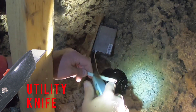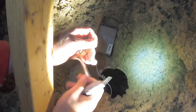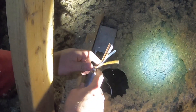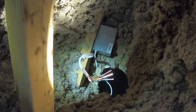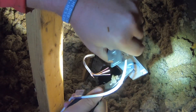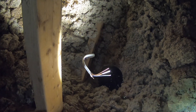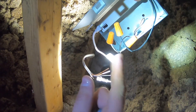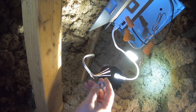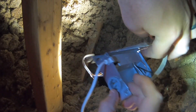We've got a little bit of work to tie all this together. We're going to cut about six inches worth of wire, make sure it's a nice straight cut, peel this back and cut it - just like that, and you have all three of your wires ready to put in the box. Go ahead and take this side off - that will help expose the box and allow us to put the wires in. The box has the ground, the common, and the hot all ready for you with wire nuts on the end. Go ahead and push this in to the spot - just like that, it's in right where it needs to be.